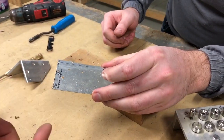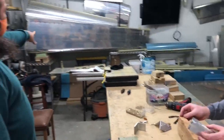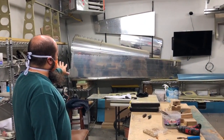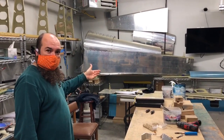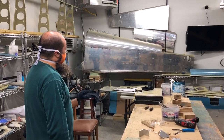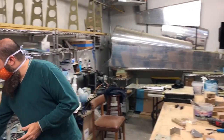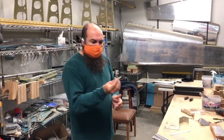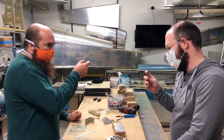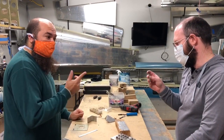This is a small piece, but if you think about one of the big sheets on the side of the airplane, you're doing a hundred holes per side. Usually on the inside where I know I'm going to prime it anyway, I'll use a piece of Scotch-Brite and scuff it all the way down so I don't have to go one by one deburring. On the outside you have to go one by one. There's also a countersink bit that chucks into the drill, which is faster but gives you less control. And this is a single-flute bit, so you have to be careful with it.